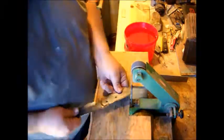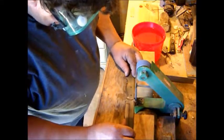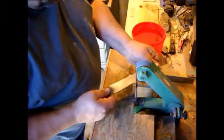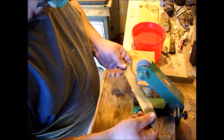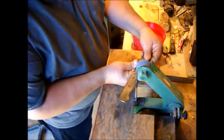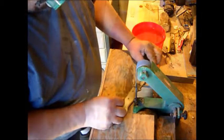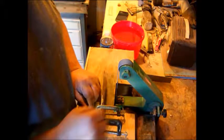Alright, I'm using a 36 grit on my belt. It takes off quite a bit in a hurry. So you want to make sure you keep your knife flat when you're working with it, or you'll take a chunk out in a place where you don't want to. It will also take off skin in a hurry, so be extra careful.